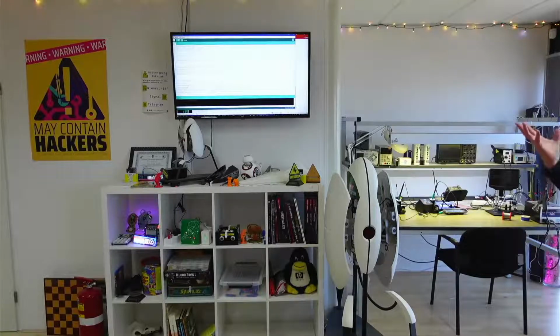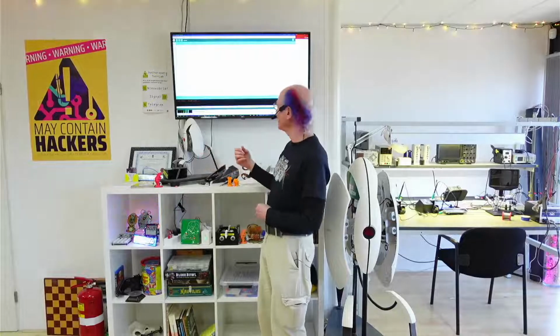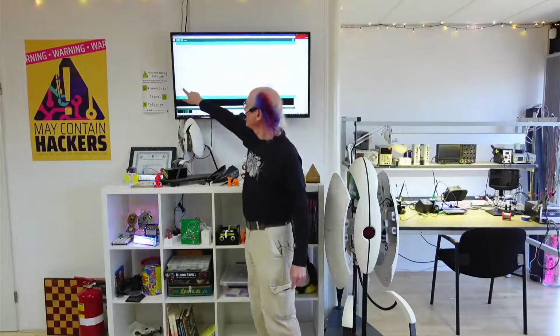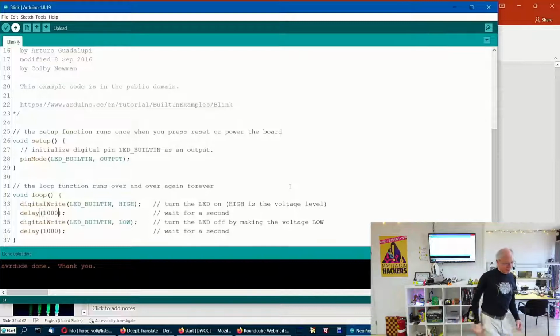But I can change that. I can make it blink 10 times faster. Any idea what to do to make it blink a 1/10 of a second on, a 1/10 of a second off? What do I change on my, let's hack this to be a little different. Yeah, so the 100 milliseconds would be a tenth of a second. Same here. So I'll just do that.